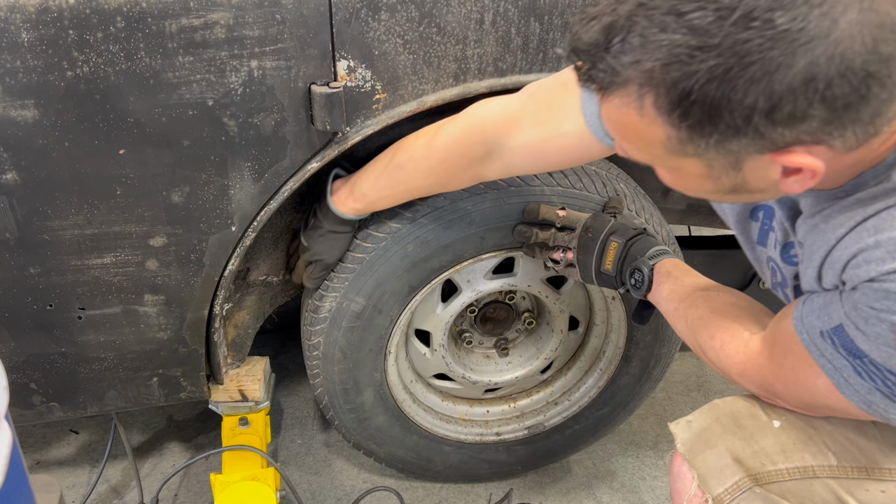The wheels and the tires, even though I could change the offset, they are rubbing on the inner fender wells. So basically I think what I'm gonna do is kind of like a quote mini tub, instead of getting spacers, instead of getting different wheels and tires.